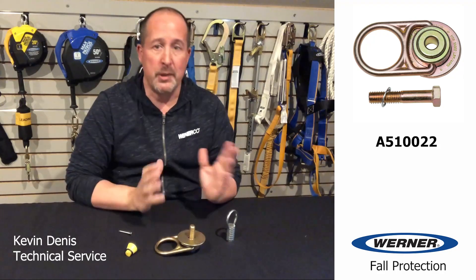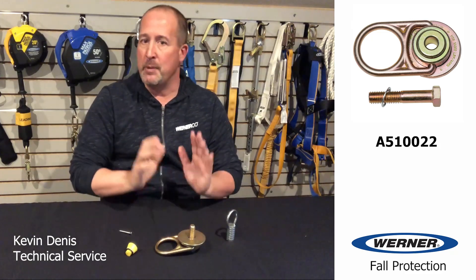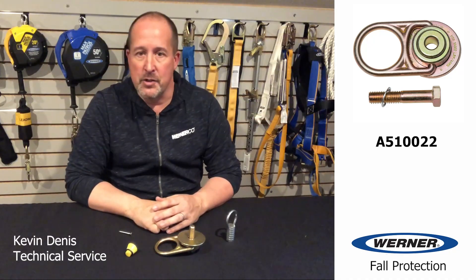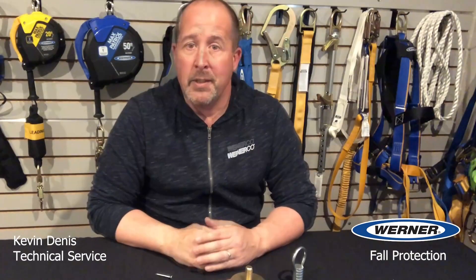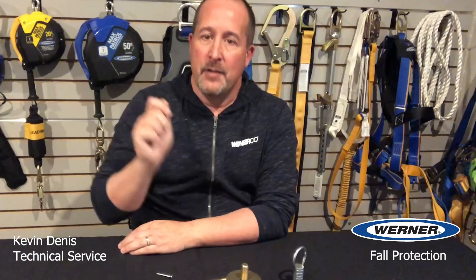The key to this anchor is pre-planning and specifying locations during the design stages of the project. It's becoming more common for organizations to place anchorages throughout their ceiling not only to cover existing work but to provide anchorages for future work expansion or equipment changes. It's not unrealistic for an organization to install 20 to 30 straight loop inserts for comparable time and cost to installing one anchor after the facility is built. Thank you very much — that's the straight loop insert and mega swivel combination. Reach out to Werner if you have any questions.